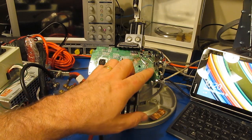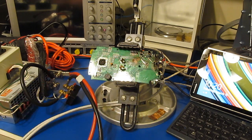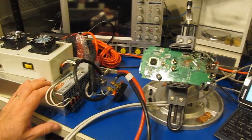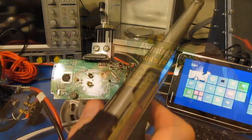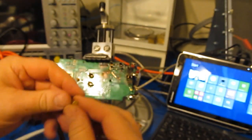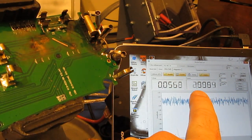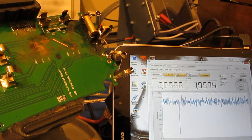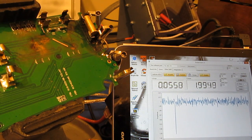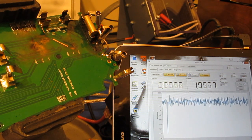So when I started looking at this meter, one of the things I was curious about was how much current this little shunt could actually handle. So I've got the big power supply back out. So the problem is we need a new fuse. Okay, we can see the shunt located right here, and this is our current. You can see I'm currently putting out 2 amps. So what I'm going to do is every 5 seconds we'll increase the current by 2 amps up to a maximum of 100 amps, and let's just see where the shunt opens up at.